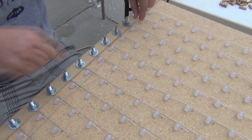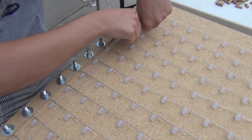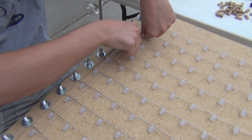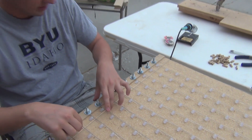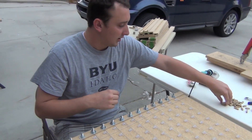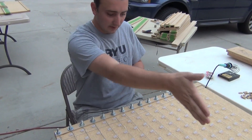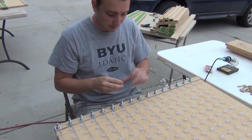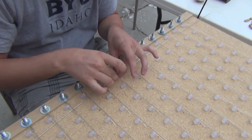What we'll do is bend these up and over and solder them next. So what's the purpose of this blue line? Every LED has four lines to it: red, green, blue, and then common, or the power. This is what will let us select blue, and then this will let us select which LED we want.